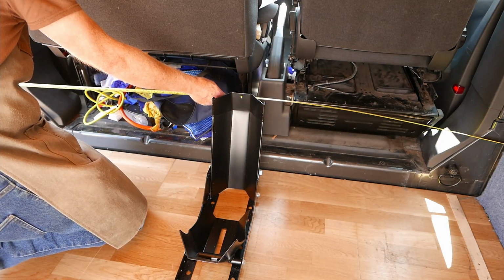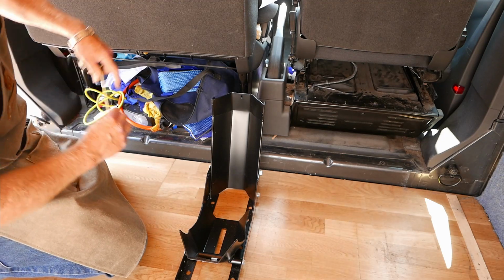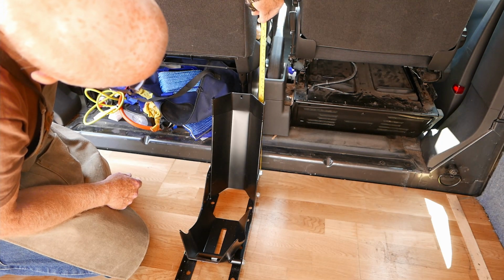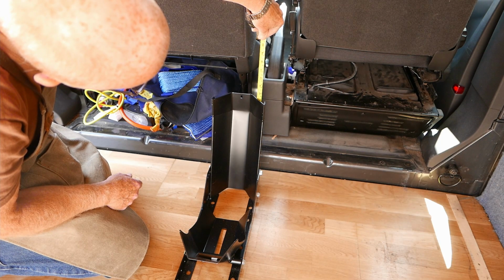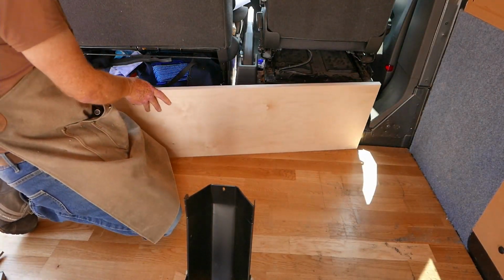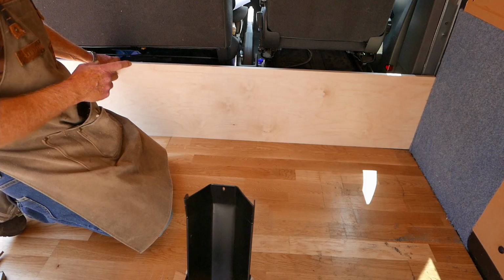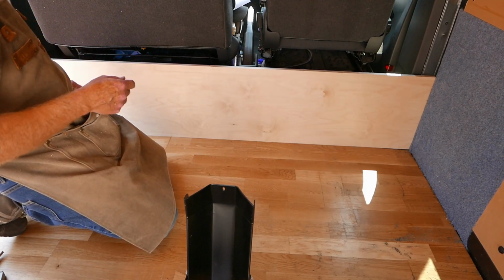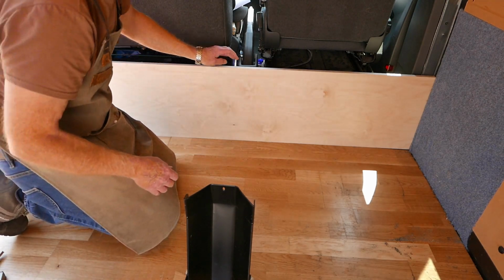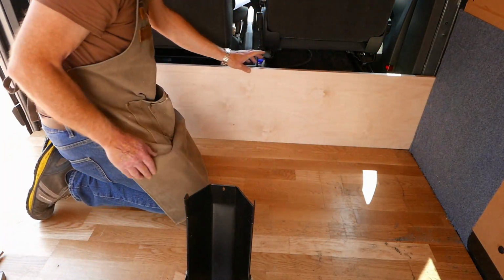And I've got a width of 1750mm. So let's have it all in metric, shall we? 35.5, 750. So the only piece of ply I've got is 1640 long, not 1750. So I'm 90mm short at this end, but it's going to be fine. It's got to be fine. I've got no other ply. This end I was thinking I'd have to scribe, but it's a beautiful fit.